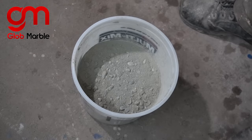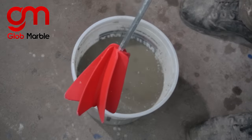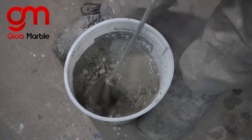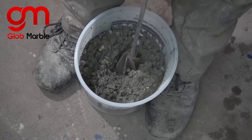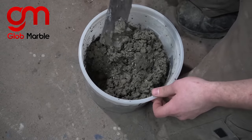I poured 10 pounds of concrete into this container and for that I'm gonna use 400 milliliters of water. Then I'm gonna mix it all up with this — you could mix it up with a trowel or even with a gloved hand, but this is way quicker. You still have to hit those edges of the bucket with a trowel to make sure that everything's completely mixed in and completely wet.